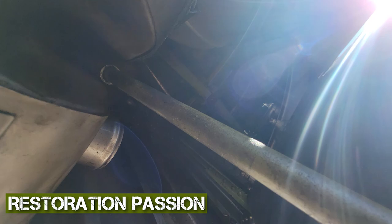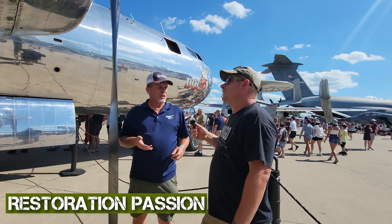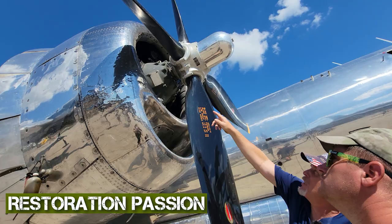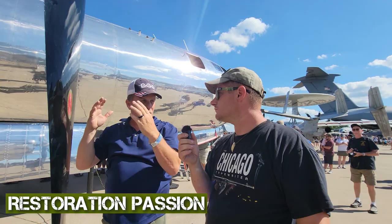That's genius. And then the airplane originally had a high tension ignition system. Did you guys ever deal with any of those in the tanks? So they're pieces of crap trying to deal with high tension magnetos. So this is actually a low tension ignition system. So what we did is you'll see the distributors. See that up there? Oh, yeah. And this one over here. See how we cut the cooling panels to fit them up inside there? So now we did away with the high tension magnetos and again built more reliability into the system.